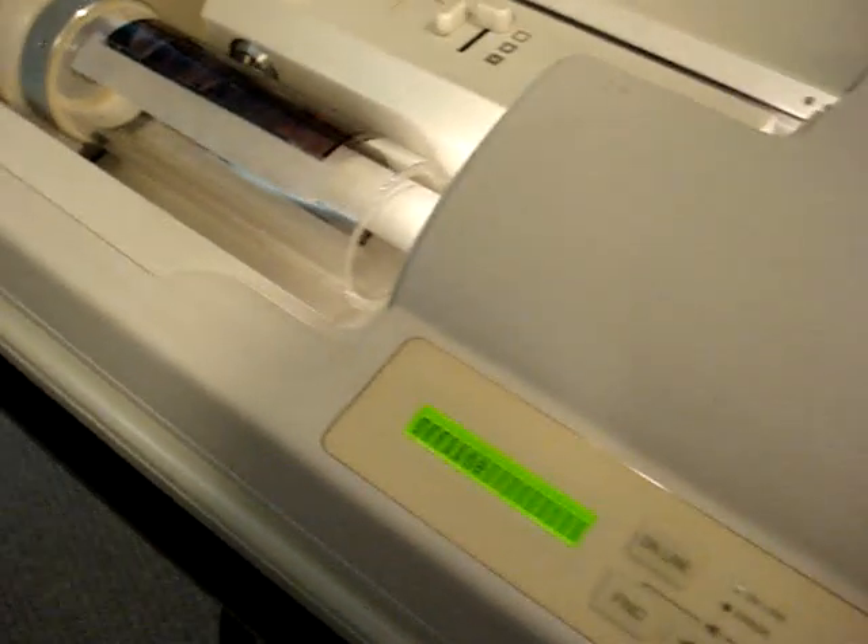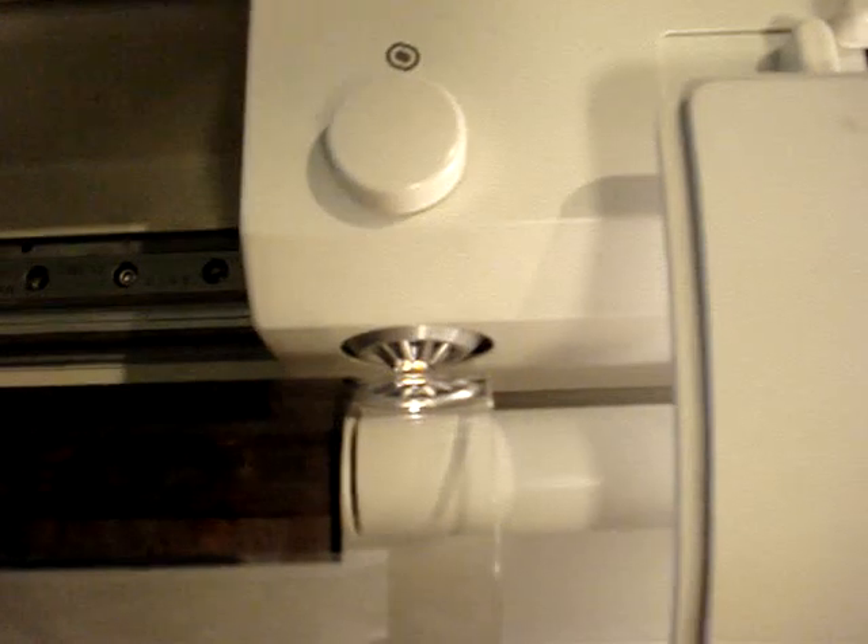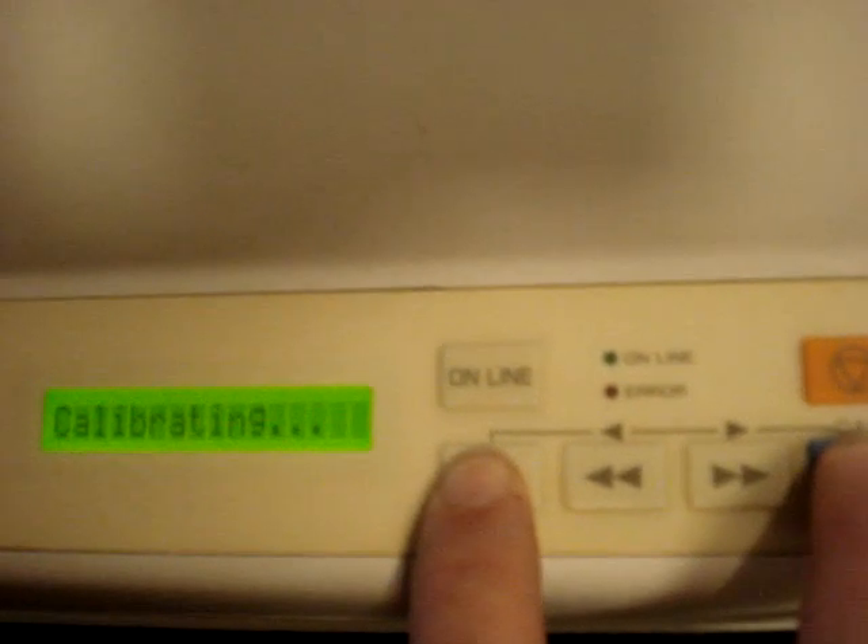I'll move the scanner head over to a clear area on the drum to do our white calibration. To do a white calibration for a transparency, we do the calibration with the reader going through the clear area of the drum. To do that, push the function key and then hold down the calibration key. You'll see it says 'calibrating.' Once you've held it for a second, you can let go. Once the white value is established, you'll get a calibration complete — or just 'calibrated' — on the display.